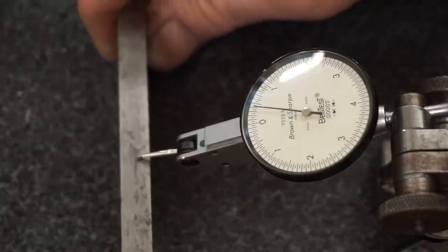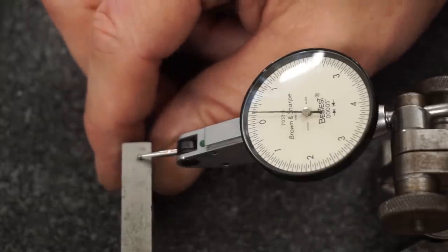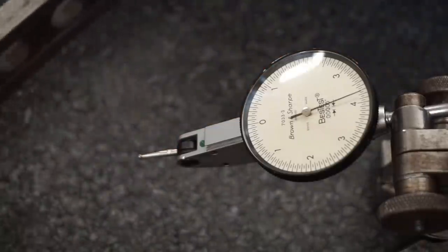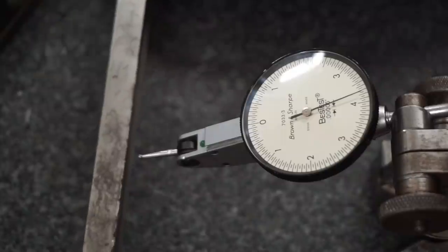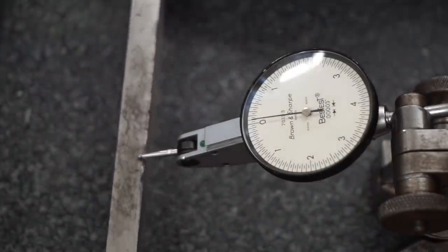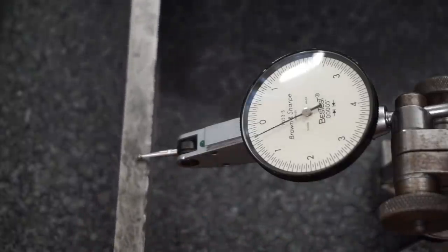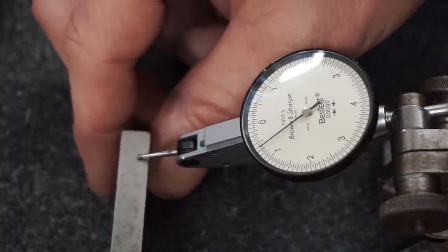And I know, guys, we're obsessive compulsing over this whole thing here. There you can see where the bow is showing up on that end, a couple tenths. But not bad. I mean, really. We were talking about this kind of stuff, just you and I. Yeah. Everyday general shop use, this is exceptional. Yeah, there's nothing wrong with these. If you're taking a piece of steel, you've got to drill holes, mill a slot, this is not going to affect your work. It's not going to bother you.